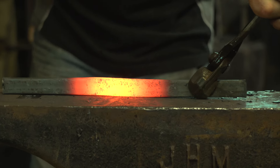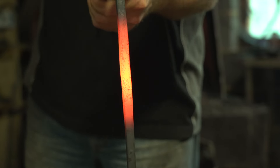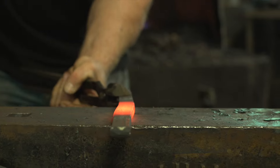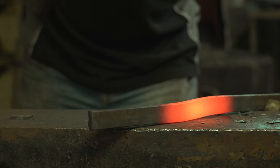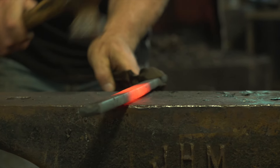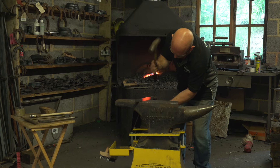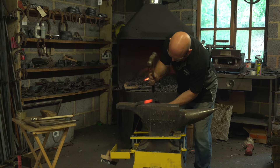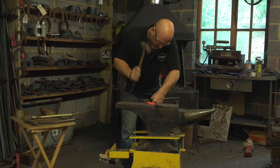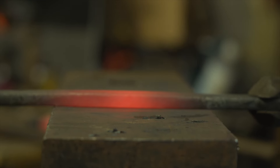So we're shortening the amount of steel but also widening the section in the toe, taking any kinks out. You can see the width increasing in that toe area. Then we're going to slightly hem the section — not overdo it — because we're increasing that width, so just knock the edge off to displace the material of our fuller, which is going to push it straight out again where we need it.